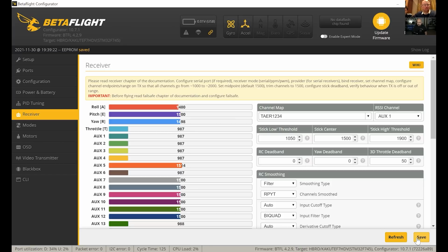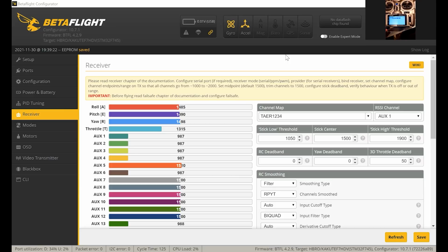Okay. So that's nice. That's good. So my throttle is roughly central. That's throttle central and it says 1254. Is that right? That's pretty far off. So that is most likely to be a calibration issue. Do you know how to calibrate the sticks on the controller? No. Long press the menu button. Now page to the, I think it's the hardware screen. There's going to be a calibration option there.